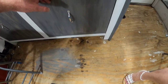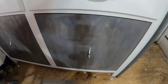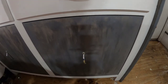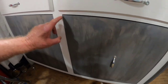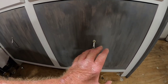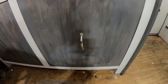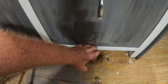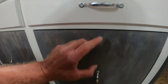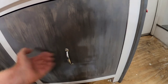And then as far as the drawer front is concerned, we lined it up in here, and then we took playing cards. The secret to using playing cards as shims is you don't want to skimp. Don't just put a couple of playing cards here and a couple over here, because it looks straight, and then stick it. No, you want to make sure that door is firmly in place. So we stuck several playing cards here, several here, several here, several here. In other words, we stacked them in where you couldn't budge this no matter what.